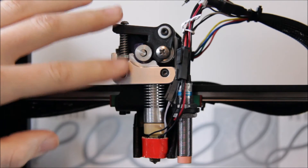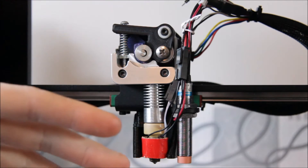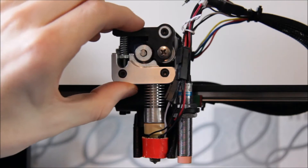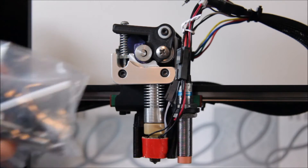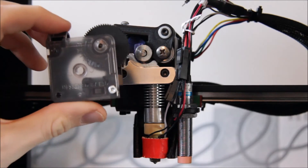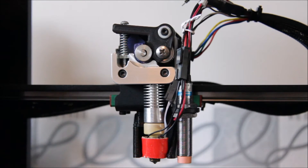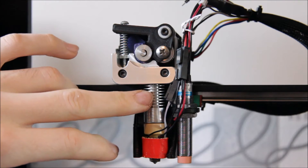I'm using the clone purely to save a bit of money. If the quality isn't good enough, I'll try the original Titan — chances are the Chinese copy isn't made to E3D's tolerances, so just a disclaimer there. Here are a few bags of bits that came with the clone extruder; that's what it looks like without all parts fitted. We're going to take the current setup off: the stepper motor is at the back, the Titan will go on the front, and the V6 will go at the bottom.